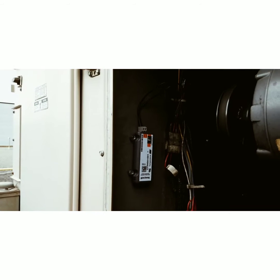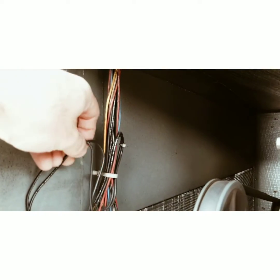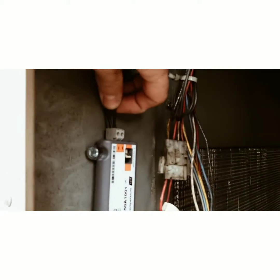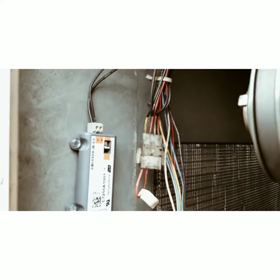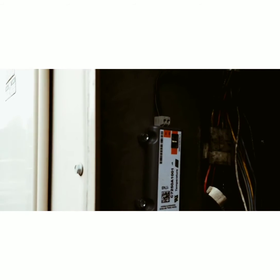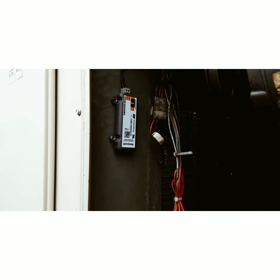There is our indoor sensor and our mixed air sensor. Now on these Yorks, they had a sensor in there already. You just take the wiring and shove it into the sensor here for the Jade. Now that is polarity insensitive — it doesn't matter where those wires go. Not a big deal.